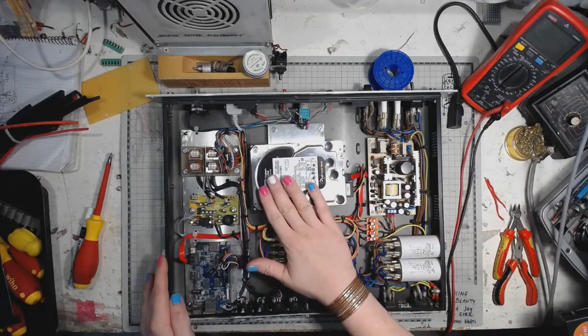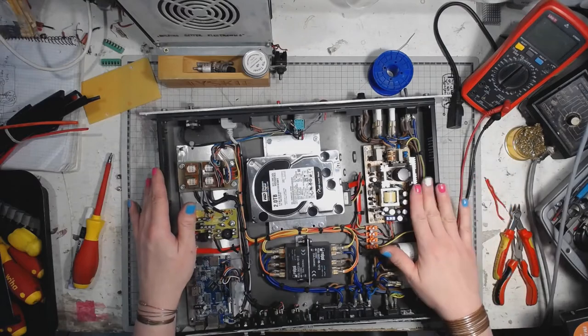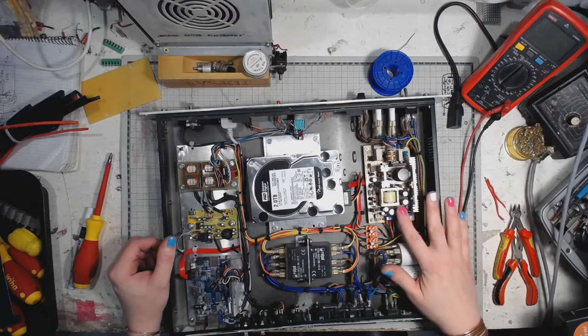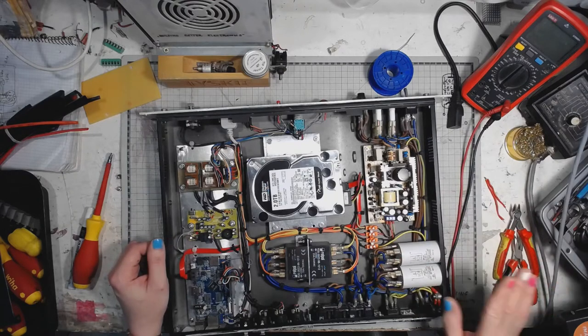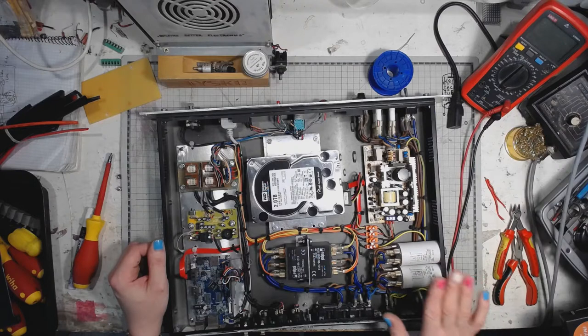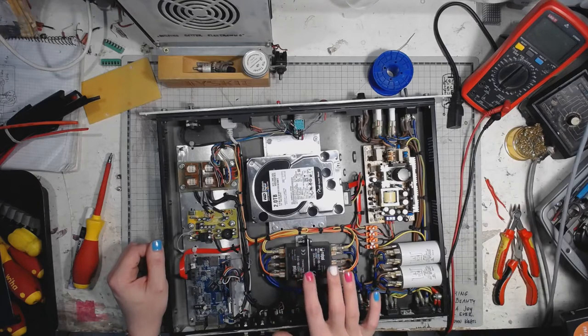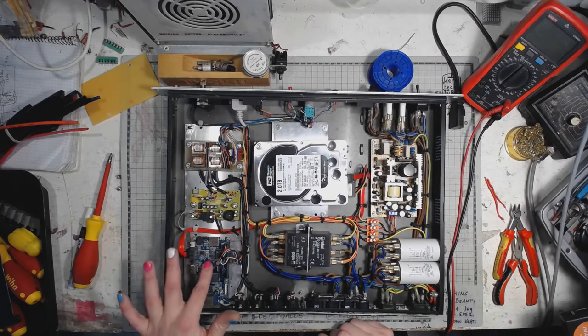Anyway, the insides of this audio computer. This is the power supply module. It supplies 5 and 12 volts DC. Those are the mains filter caps, the outputs. Then the AC control relays. This is the Orange Pi PC Plus.